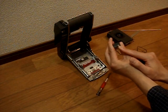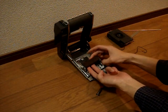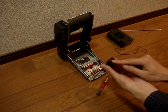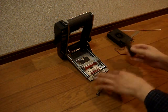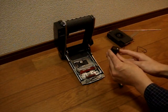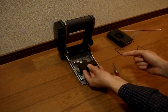The pins are in now, tapped in nicely, and the block now slots in like so and rests on there. It's important to do the two front lock pins first before drilling the back pivot pins, because this lets you align the position and then locate the back rod later. The basic construction of my design requires just the two pins and the block to be steady in there.